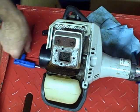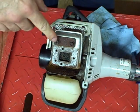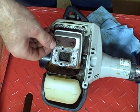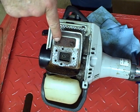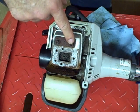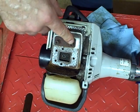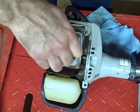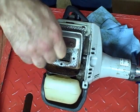Another important thing: these bolts were rusted, and I couldn't really fit the Allen wrench into them all the way. It's really important that you clean these bolt heads out before you start to loosen or tighten them, so that the tool fits properly on the bolt. Otherwise you can round out the bolt or even damage your tool.